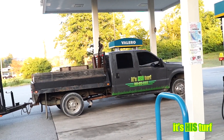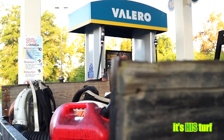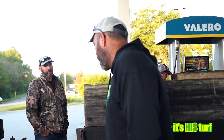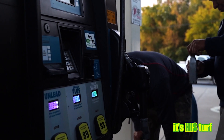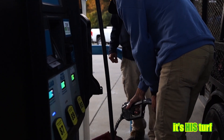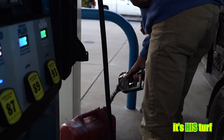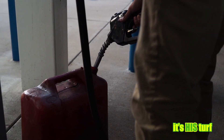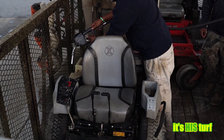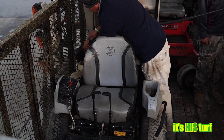This really just didn't make sense for what we were doing. So what we did is we just had a little class one morning, got everybody down there and explained to them: if it's a two and a half mix, we got to put two and a half gallons of fuel. The thing we did to make this very easy for them is we told them that the first thing they're going to do when they get to the gas station is when the meter was on zero, to first fill up their jug. So if they were putting in two and a half gallons of mix, they would only do two and a half gallons of fuel. And then if they were going to do five gallons, they would do five gallons of fuel. That way, they could fill up the mowers, they could fill up the truck, and it didn't matter what it came out to on the meter after that.